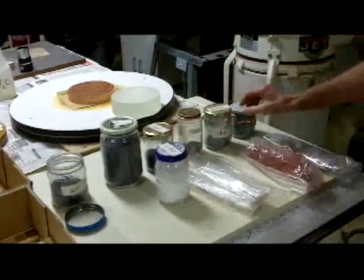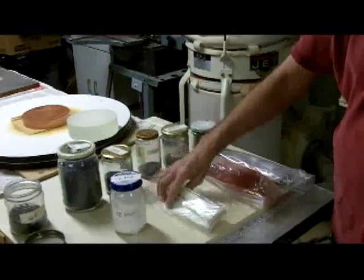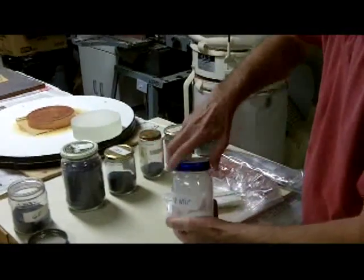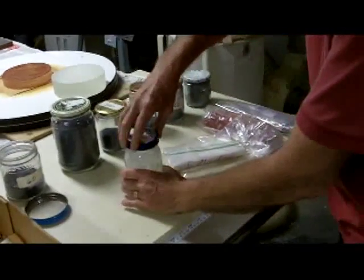And then once you get to the 500 grit, which is really still just grinding and chipping off glass, you go to 12 micron and then 5 micron, which looks to be about the consistency of flour, but it's still a grinding compound.